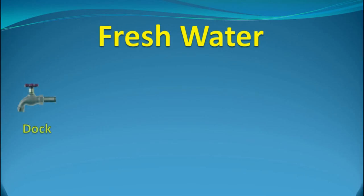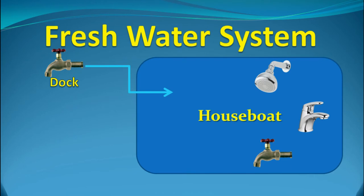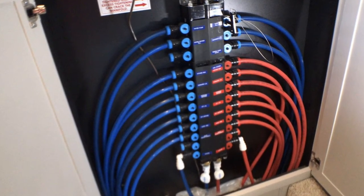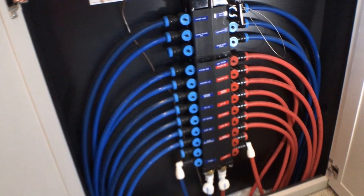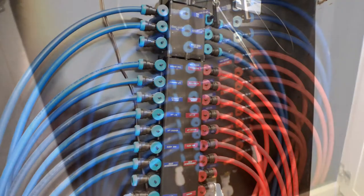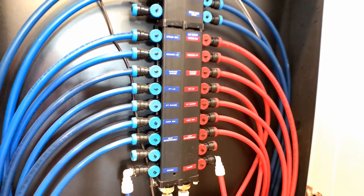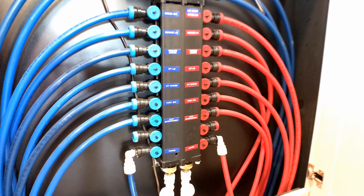The water from the dock is fed into the boat's fresh water system and used throughout the boat. Before it goes to showers, vanities, sinks, hot water tanks and the like, it goes to the manifold. Water manifolds like this one started appearing on boats around the year 2000. The fact that they appeared on all newer houseboats makes me think they were mandated by the American Boat and Yacht Council. This manifold controls the distribution of all fresh water to the fittings on the boat and allows you to open and shut off supply as needed, particularly when winterizing the boat.